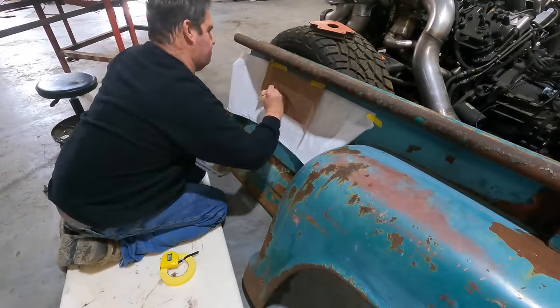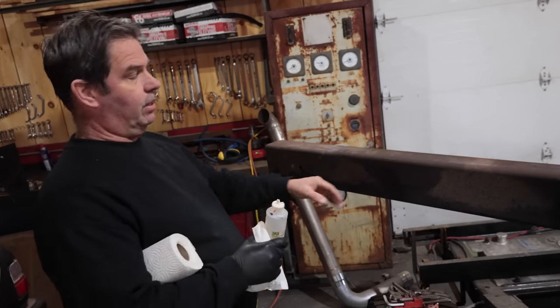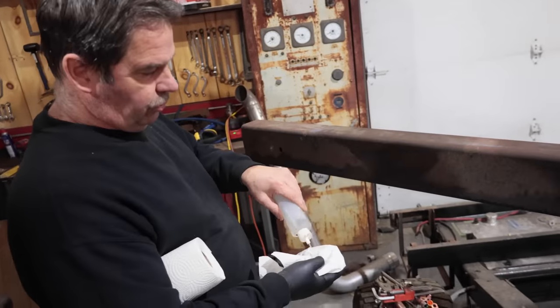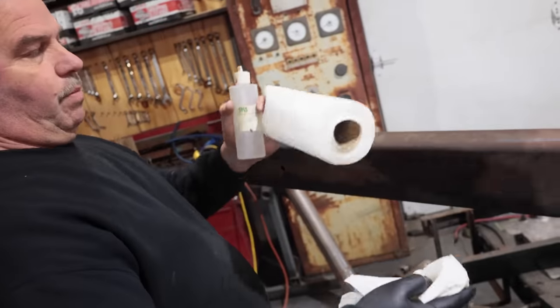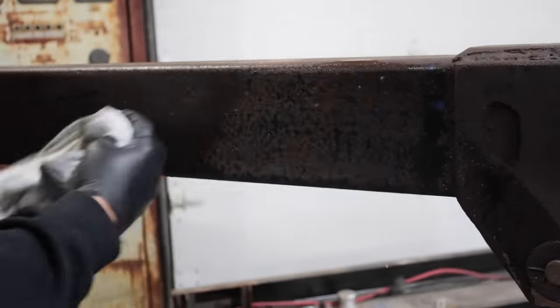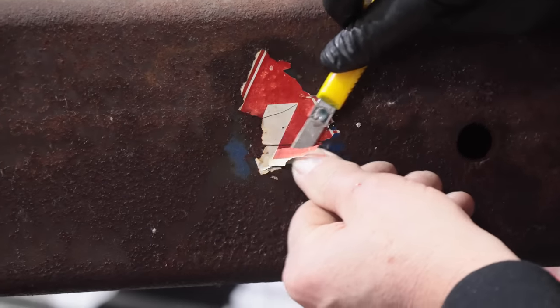For the beam here, you can see the oil that has dripped over it — that's going to be a problem for getting the lettering to stay on. So what we've got to do is degrease it. We're using a degreaser that most automotive body shops use. Not only will it cause the paint to fisheye, but it'll keep it from adhering.